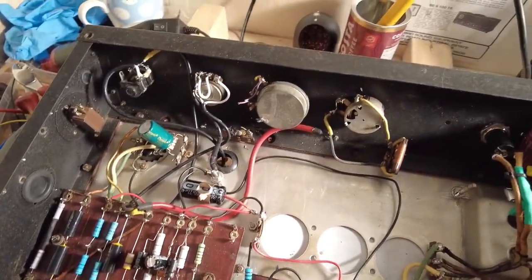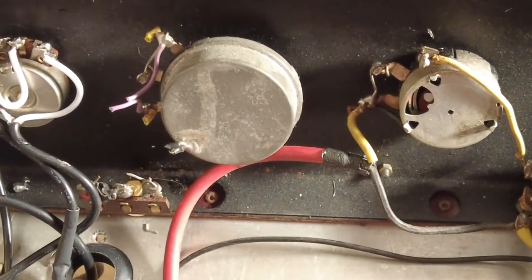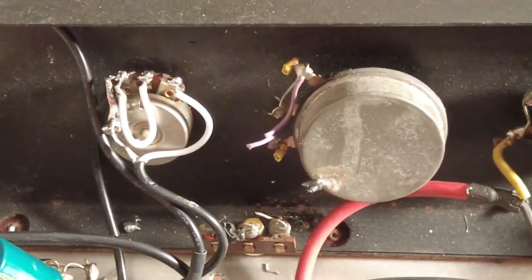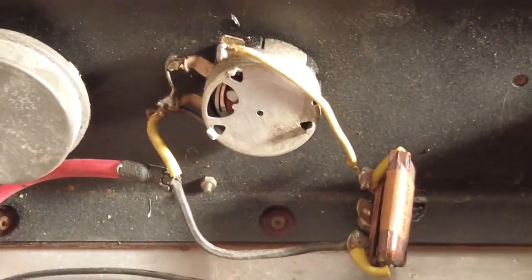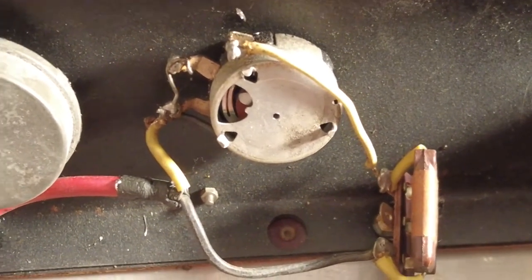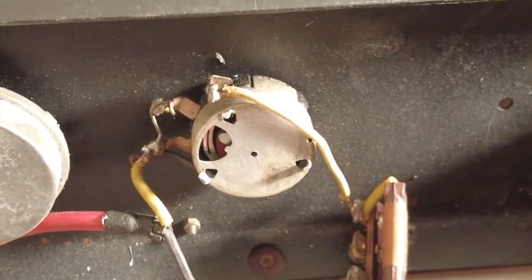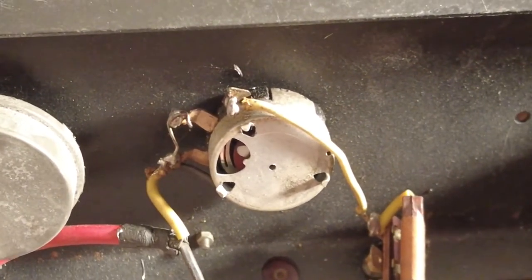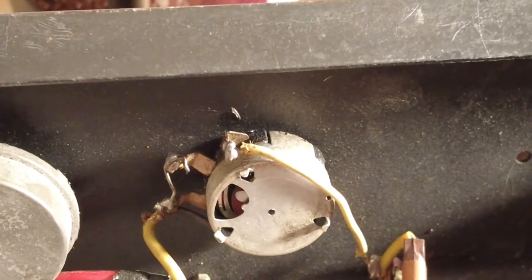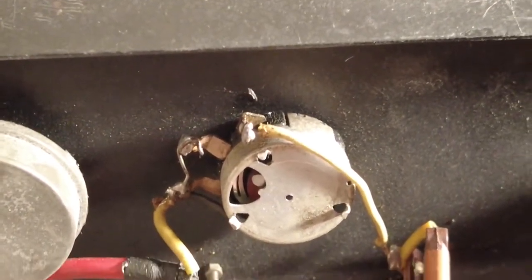That pot there, which we now obviously don't need, I can't get the knob off that. It's absolutely solid. I managed to get the other one off. We fitted that pot. The tone controls were wired back to front, that were obviously from the day it was made. So we need to swap that around. Tone's a bit strange, it's a bit all or nothing, but we'll look more into that. This amp is incredibly loud. I've not put a guitar through it yet, but it really has got some signal. It's some volume.